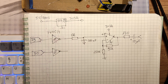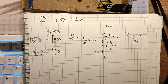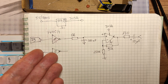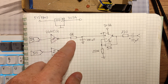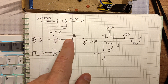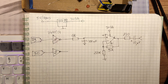The solution is actually very simple. You just take a regulator — an LDO. I used a drop-in replacement with everything on board already, and you create a clean power source. From that, you power your Schmidt trigger or any other kind of logic gate. You pass the PWM through it, and from dirty PWM on one side, you get a perfectly clean PWM on the other side. And this you can already filter properly.